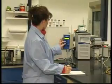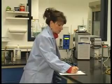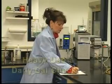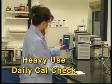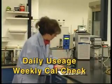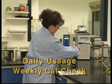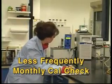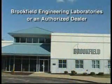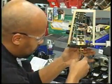A common question is how often should a calibration check be run? The answer is really up to how often the instrument is used. For example, if an instrument is being heavily used, say on multiple shifts, a daily calibration would ensure accuracy. Daily usage five days a week may require a calibration check be performed at least once a week. For instruments used less frequently, perhaps once a month or once every few months will be fine. But to ensure the health of your instrument for many years, return it to Brookfield or an authorized dealer once a year for a full calibration, certification, and cleaning.